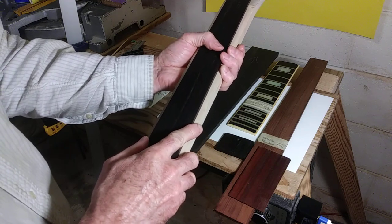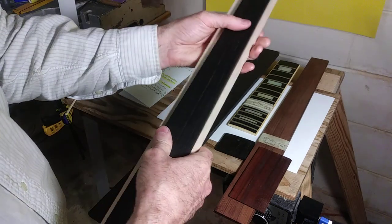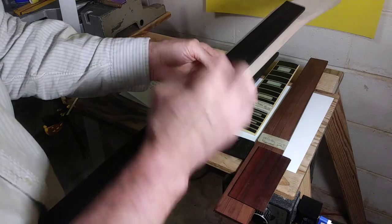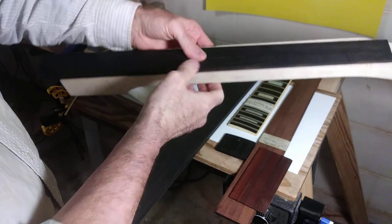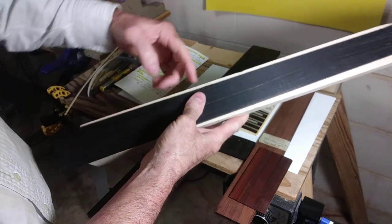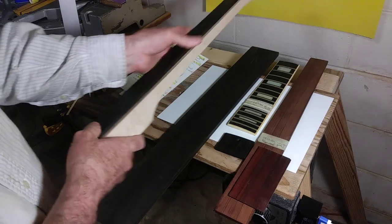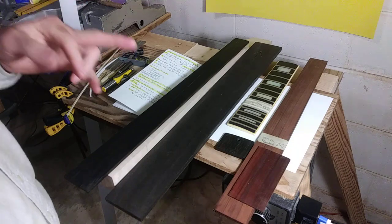I probably rushed a little bit when talking about how Benedetto did his guitar necks — that was back in the 80s or 90s. I have no idea how his company is building them now, or how Gibson is building their necks. But if you're sitting in your backroom shop, you can use the neck as the platform to work off of — cut all your fret slots, glue the straight edge on perfectly centered, and do everything by hand with a little flush-cut saw. It doesn't have to be with a $300 miter saw jig.